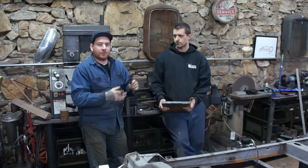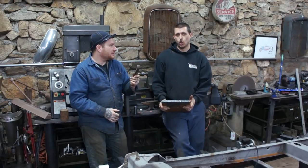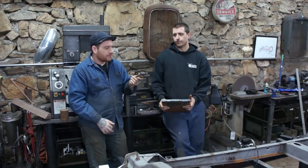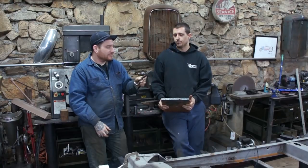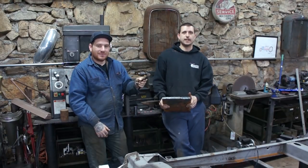We're going to cut the shape out of that, and then sand it down to look right, and we're going to make it about an inch longer so we have quicker steering for when we potentially put this on a dirt track, so we're not yanking on the wheels super hard to just make a turn.